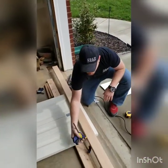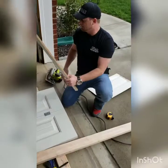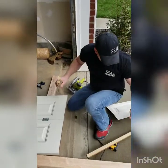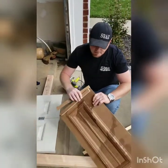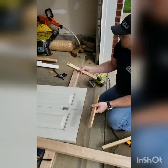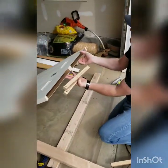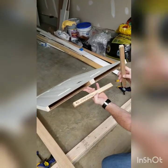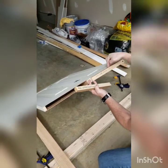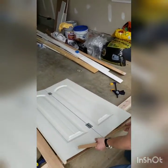Moving on: when you take this little cutoff part, you get these little one-by strips on the sides and on the bottom. The bottom already had holes drilled in it, so what we did is we just took the Luan — this Luan's glued on — you pull the Luan off these pieces and you're left with just the strips. When you cut a hollow door, this is what it looks like inside — it's hollow underneath and you can see the panels. You just take these little pieces out and insert them back in, apply some glue, set them flush, and then you can paint the door and install it.